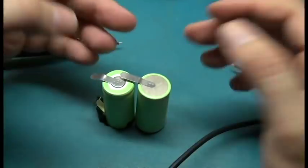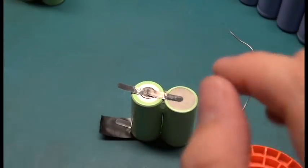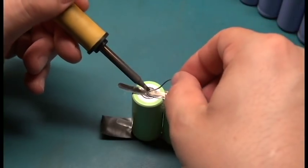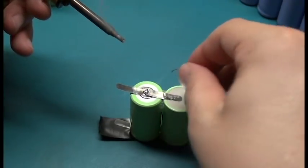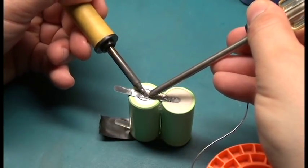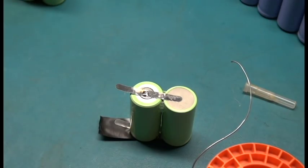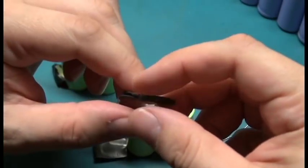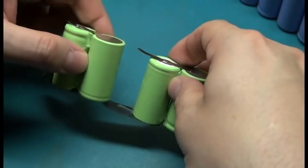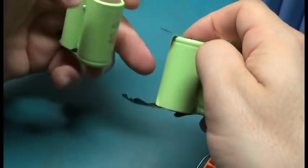I'm probably going to glue the pack together first before soldering, just to make things a little bit easier. I've soldered one pack, and on this second pack I'm putting a little bit of flux in to make things go easier. Now that I have two of these soldered up, I can make one full pack — solder the resistor in between the two battery cells and glue the rest of the pack together. I'm using regular hot glue for now. You can always get hot glue off with alcohol — there's a tip for you.